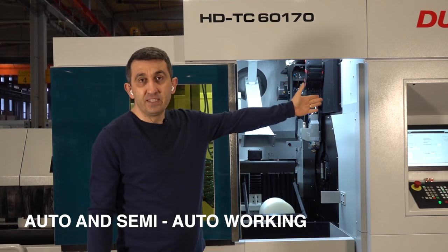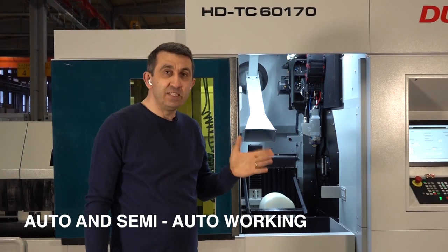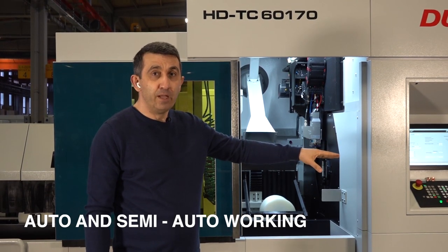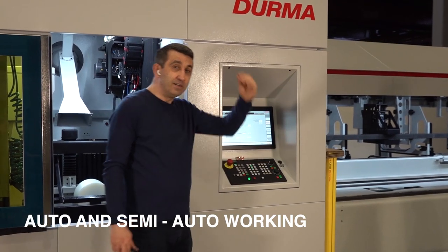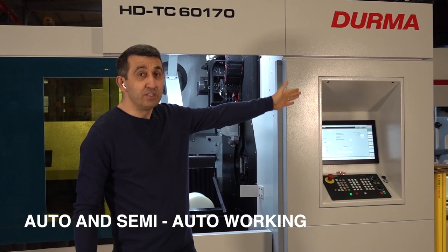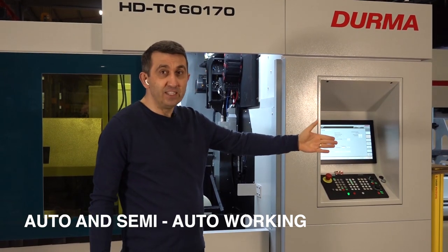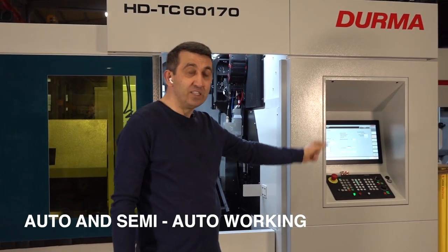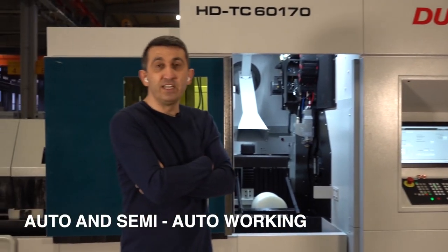So I am thinking like that generally. You are cutting 50 pieces, same profiles on the automatic loading, but one customer comes or your supervisor comes to you and says, Hakan, please pause the job and cut these profiles. When you have this semi-automatic loading option, you put all the tubes, you come to the task manager, and you call the program, up to 10 different profiles to be cut. When you press start, you are pausing the back automatic loading, and you are inserting 10 different extra jobs. At the end of these up to 10 profiles, you can come back to your previous job. On this machine, it's not possible. When you buy the front semi-automatic loading option, it is possible. We have one machine in Holland working like that.